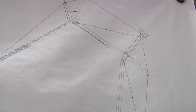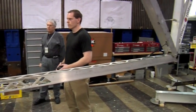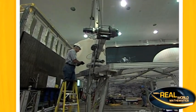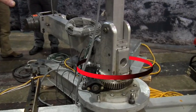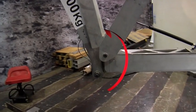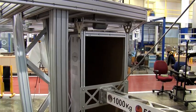We're also designing a parallel jaw gripper so it'll act like your hand pulling together to grab a doorknob, and be able to pick up some very small payloads and delicate items. The LSMS looks like a typical lightweight crane, but advanced NASA engineering makes it more capable than anything you'd see at a typical construction site. The device has three degrees of freedom, much like a person. It has a waist rotation at the base, a shoulder rotation at the top of the king post, and an elbow rotation at the mid-span of the boom — like the human body with one arm, a shoulder to give elevation and an elbow for additional articulation.